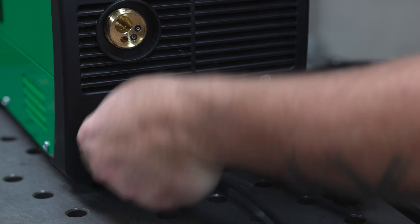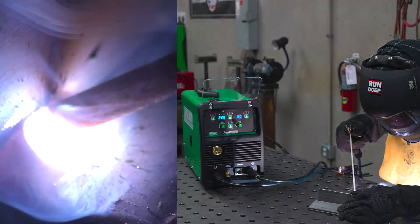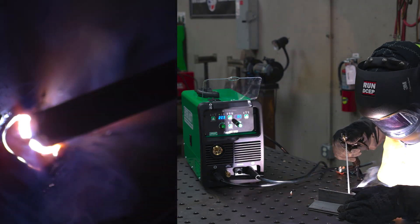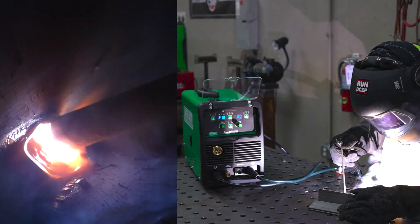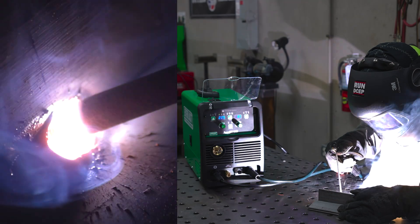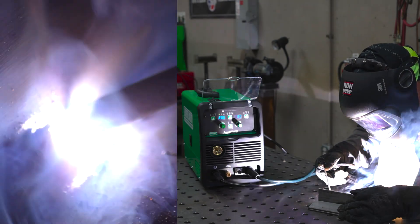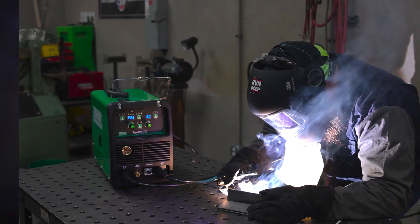The workpiece clamp goes into the negative. I'm using a 3/32 diameter electrode with 80 amps — I just want to push the limits of this machine. Using a slow steady drag technique on some 3/16 material in a regular T-joint configuration, it seems to be welding along pretty nicely. This would be a great machine for home hobbyists — trailer repairs, thin gauge sheet metal, things of that nature. You're not going to find too many 110-volt machines capable of running a full 7018 electrode, 3/32 diameter on 80 amps.